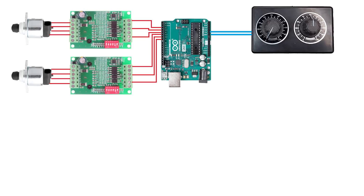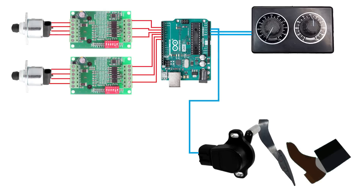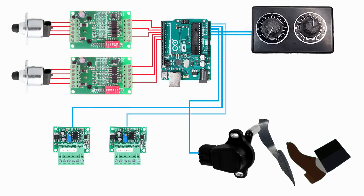So now we need to add some sensors. The first one will be the throttle position sensor. This one's a little tricky, but we can monitor the position of the accelerator pedal and that should be good enough. We're also going to monitor the RPM with a simple analog tachometer interface, and the approximate vehicle speed will be handy to know, so we'll monitor that with another analog interface. So far we have three sensors, and that'll provide basic information so the microcomputer can adjust the fuel and we don't have to roll coal every time the car accelerates.